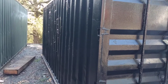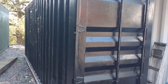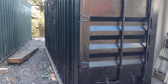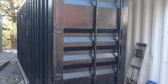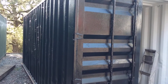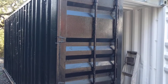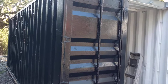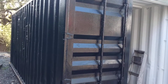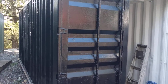I'll strap them at the top with either cable or a ratchet strap — there shouldn't be too much pressure pulling them away. Their job is to keep the sides of the hole from touching the sides of the container. I don't want earth or gravel backfill directly touching the container walls, mostly to keep moisture away. The wood will act as an additional layer with a little bit of an air gap, so hopefully we won't see any rust.